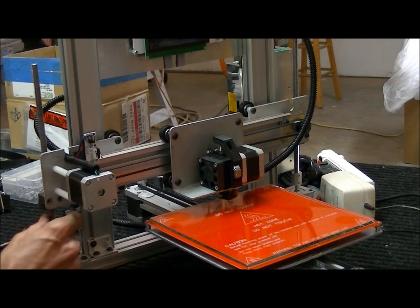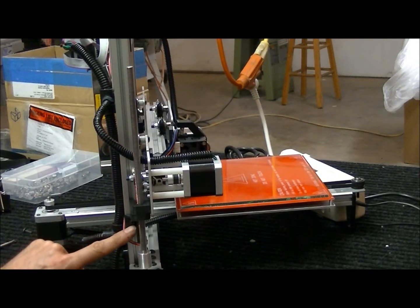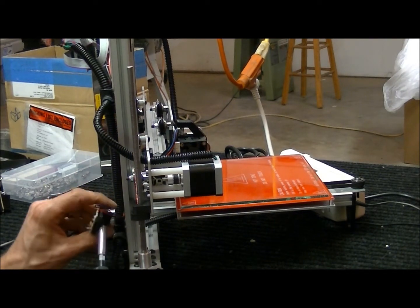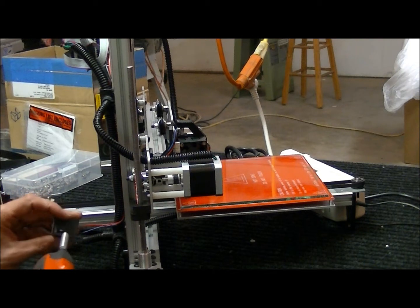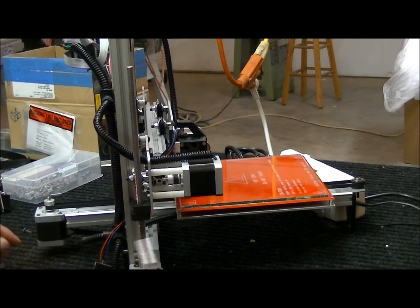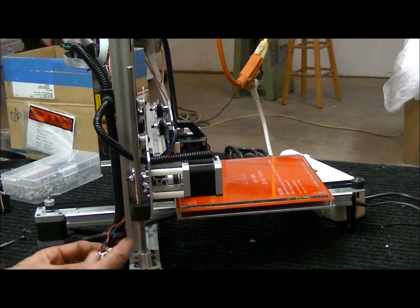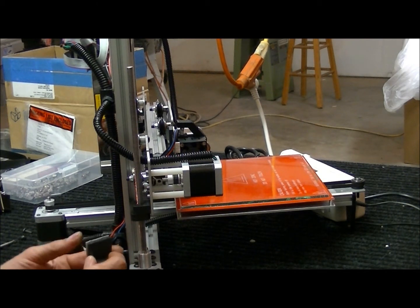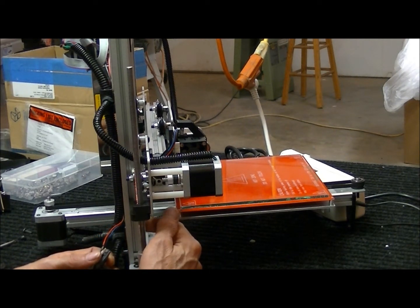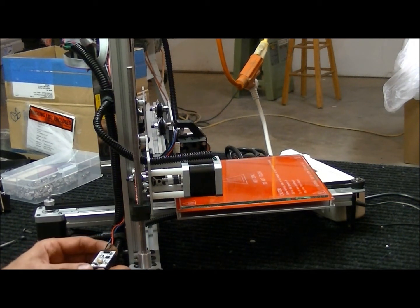You can just leave all of that loading there. Then what we're going to do is loosen up the screw that's holding that end stop. We've just removed that. Now you want to keep this screw for the other plastic mount, which is different. Before you go taking this apart, I recommend that you actually go and print one or two copies of the actual new Z-axis mount, which is listed on the website, so you can download it and print it.